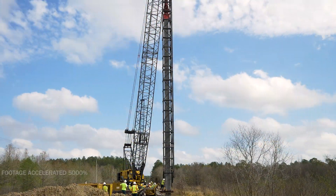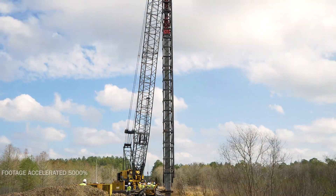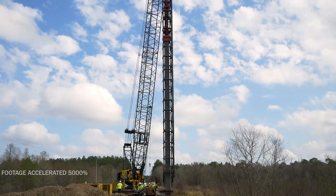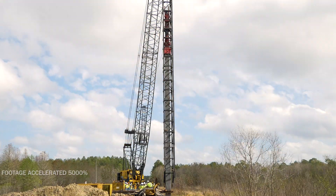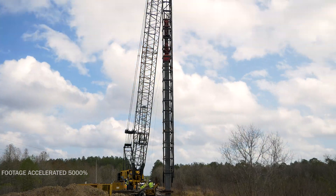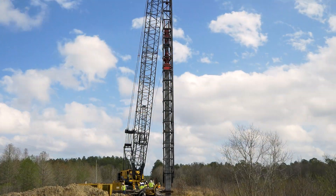Here, we can see accelerated footage of the installation of the piling in action. As was the case with our square piling, the installation of our H piling went just as smoothly and was largely a non-event. The CoreTough UHPC H piling was able to cut through the sub-surface strata with little resistance and never dipped below 100% integrity at any point during the installation, despite enduring roughly 2 million pounds of pressure at its base.